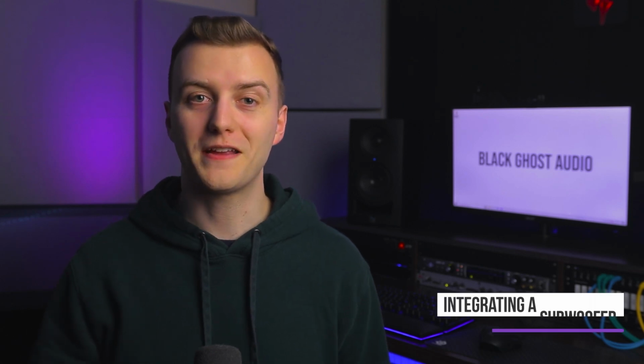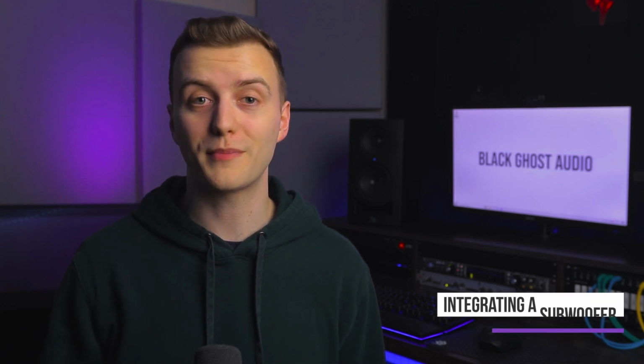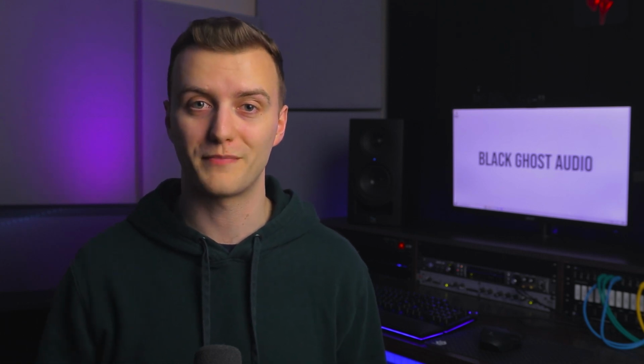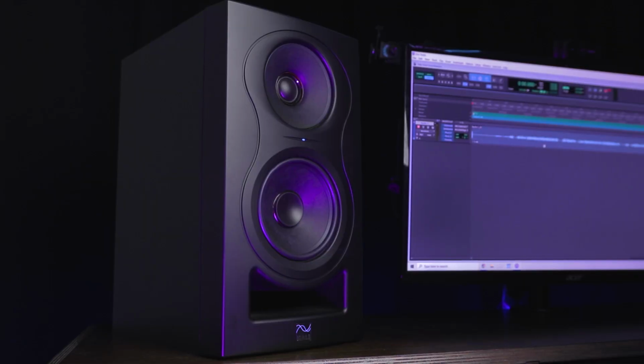One of the most significant issues you'll run into with small speakers is a lack of bass. Their cones may not be large enough to move the amount of air required to reproduce bass frequencies accurately. Frequency response is specific to the particular monitors you're using, so simply stating that all small monitors don't produce sufficient bass would be somewhat inaccurate. Speakers that produce less bass are less likely to excite room nodes, but the glaring issue they present is that you won't be able to hear sub-frequency content.